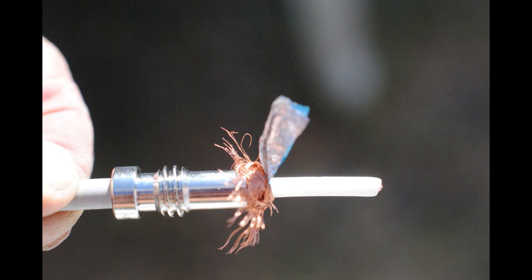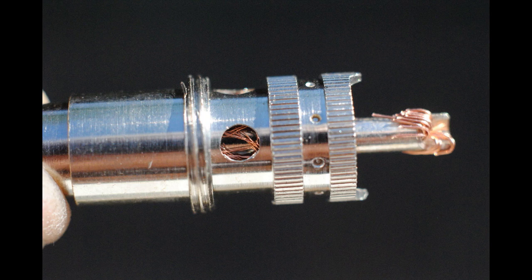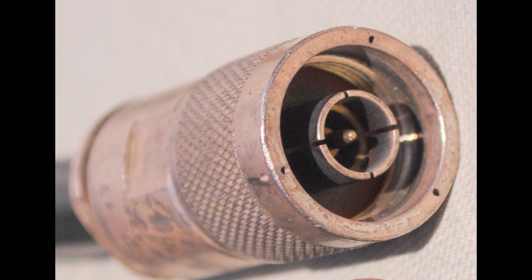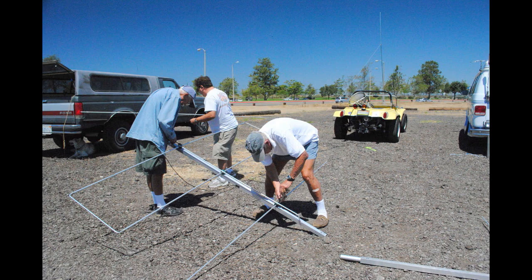Now here's where small coax matters. When you solder this, you've got to get rid of the 100% foil — keep the braid. Sometimes you think it's a nice, clean connection, but look at this — we took it apart and they hadn't even soldered it. Oh my God. So make sure that you wiggle the coax and it's well soldered. If you've got UHF connectors, double-check for continuity. Put little chokes on the smaller coax to keep RF from coming back into your station.